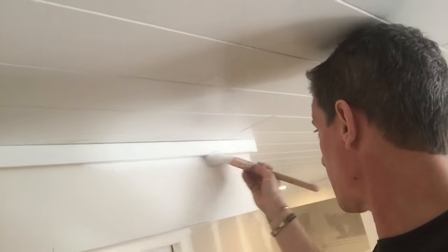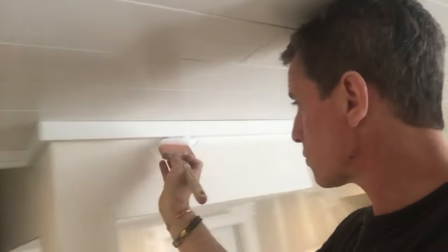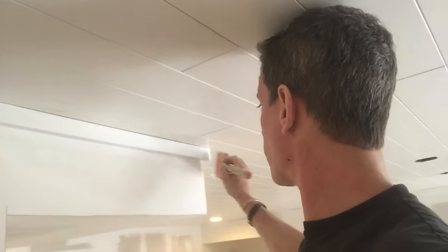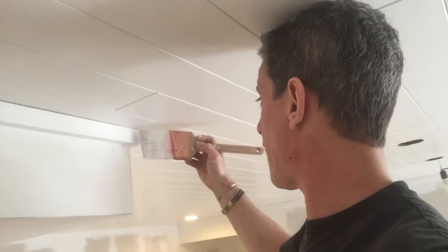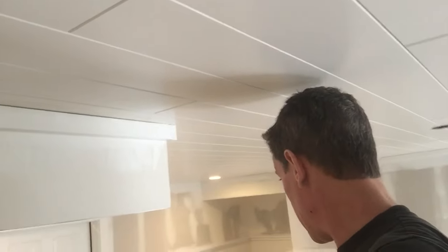And as you can see, I haven't painted the walls yet or these other vertical surfaces. So there's no need to cut in at the bottom. What I do instead is I overpaint it a little. What this does is, 1, it's faster, 2, it's easier, 3, it seals the caulk bead. So when I come in later with my wall color, which is going to be a green on this one, I think, I can cut that into paint that's already on there. At any rate, that's just the tip of the painting iceberg.